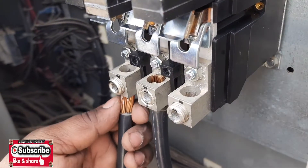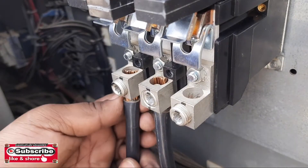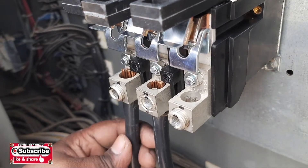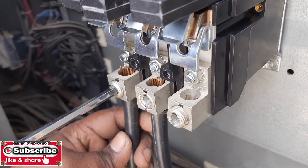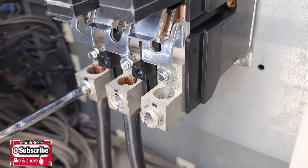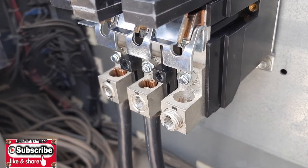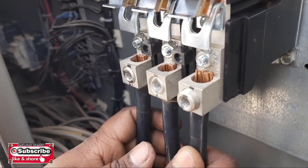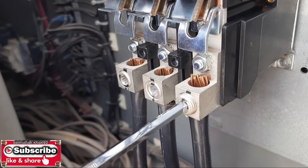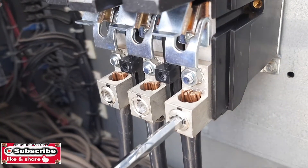You also need the star Allen key to fix these. Make sure all three cables are on the same position as where you removed them from — you must remember which cable came from which place. If you write it on paper or mark with tape, that's good. So we fix this one — our last one is remaining. All three phase cables are now complete, both from the compressor side and the supply side. It's not a big deal, it's very easy to fix the contactor.